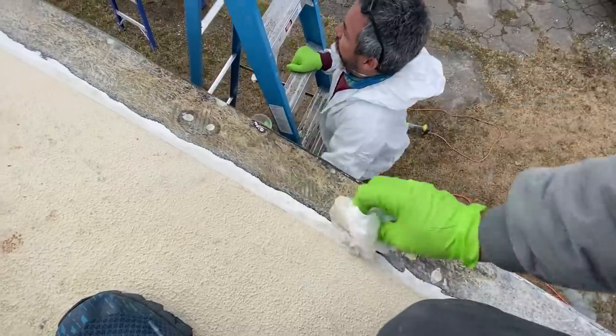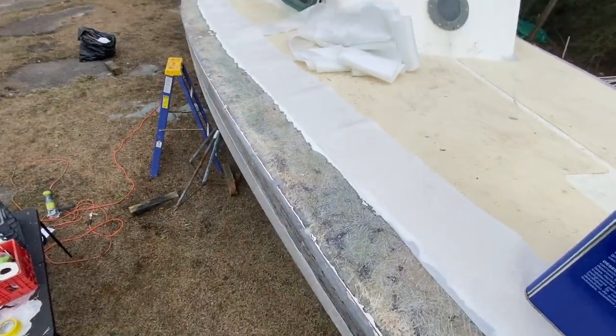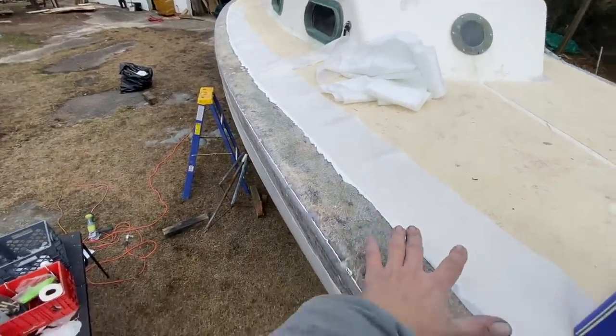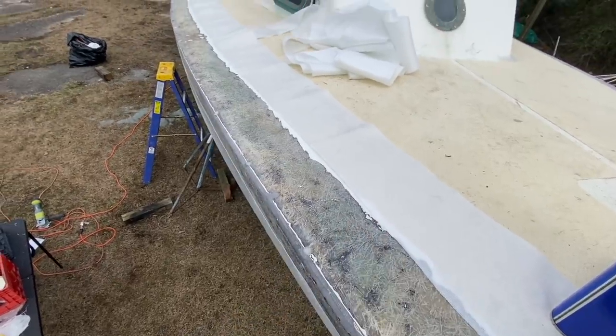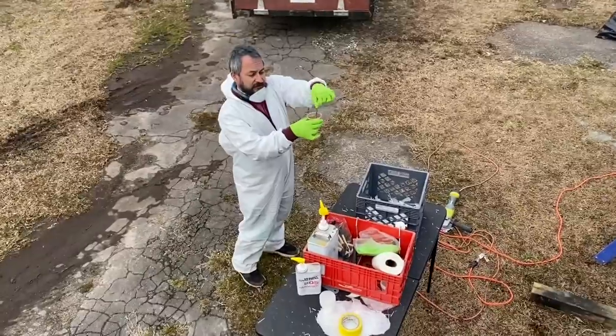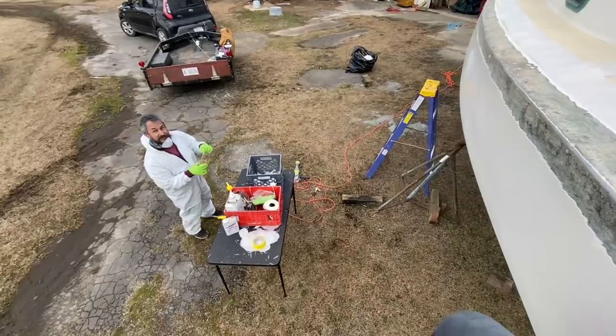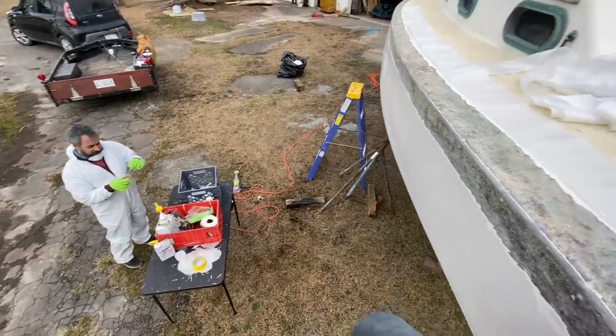Racing the rain here. So the surface is prepped. We've rolled out about 10-foot sections of this fiberglass tape, mixing it good. And it's about 55 degrees now, you think? Yeah, it's getting cool. Getting cooling off, that'll give us plenty of time.